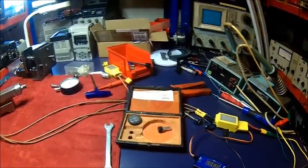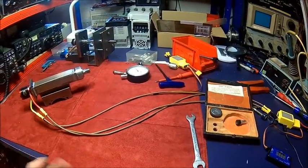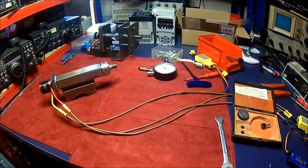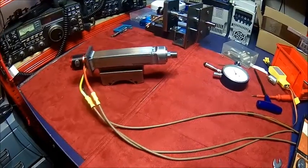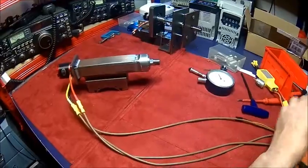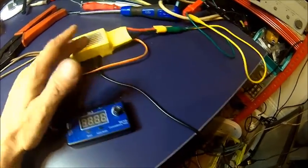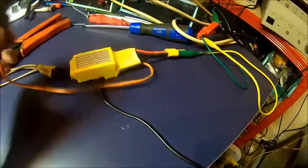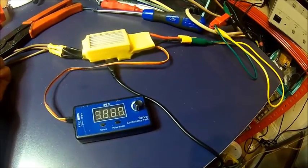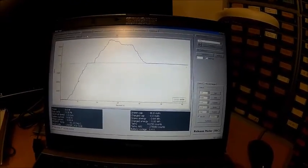I'm going to turn the power supply off because it's so noisy. But I like it — it's very capable. The only problem I had was when braking too fast: it regenerates into the power supply and then it goes into overvoltage as it's supposed to do. That should conclude the setup for the toolpost grinder. We use an electronic speed controller used for electric skateboards, model boats, or airplanes. To make it simple, you can use one of these servo testers and just set your speed. You can set all your limits in the software — I put a link for the software in the description as well. There is a motor tune function and lots of other stuff.